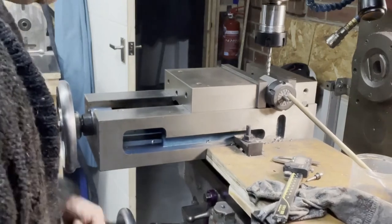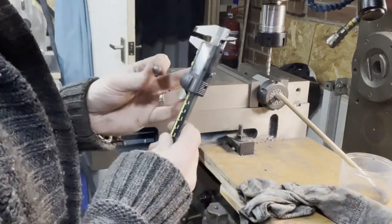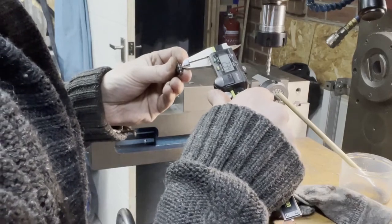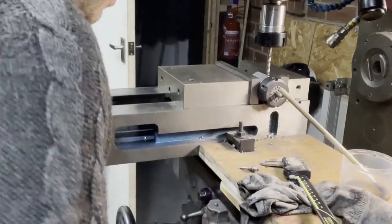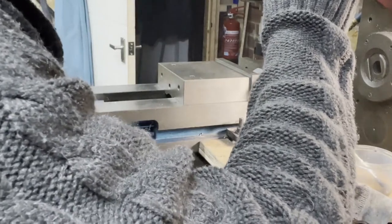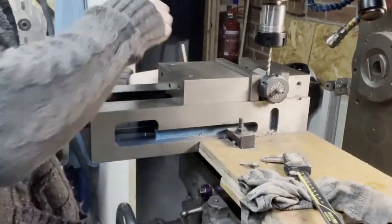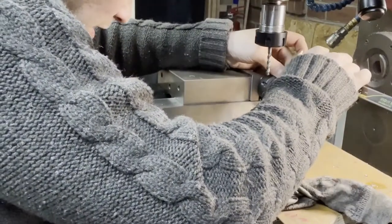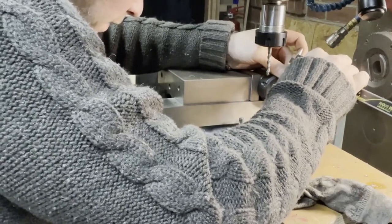So, we need to bring this over. Now we've got a little shoulder, which again isn't hypercritical, but what they're missing there is 2.3. Bring that down a bit. Bring that there. Lock that off. We'll put a little stripe so we know where, just a little bit of marker so we know what we're missing.